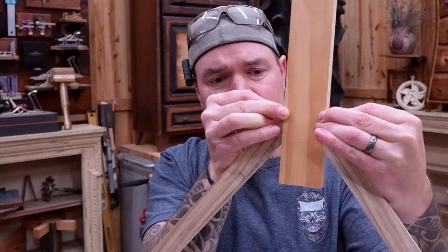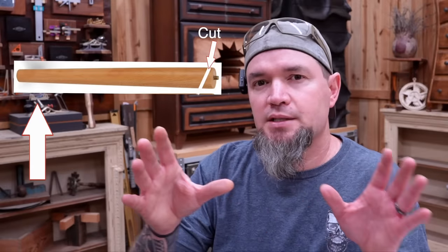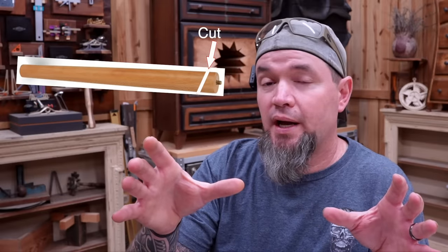To find the angle I just used scrap wood and square stock, so if you want to make square legs, you just do the same thing. Now that we know we need a 50-degree angle on each leg, the next step is to cut those. Most people are going to do this with a miter saw, but there are several different ways. Regardless of how you do it, you have to take into consideration that this is a tapered leg, so whenever you lay it against your fence to make a cut, the back is going to be smaller — it will shift the piece of wood out of square, changing your angle. To keep that from happening, measure the width of the thickest part, which is the end we're going to be cutting, and shim out the back the same distance away from the fence as the front of your leg. Now with the legs square against your fence, you're ready to cut your angle.